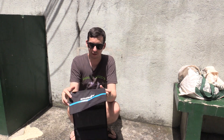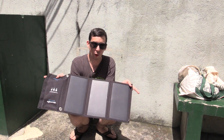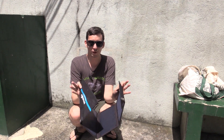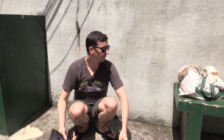Now the thing is, on the front of this it says 20 watts. In the instruction manual it says 15 watts. And in my testing, it's actually a maximum of 9 watts. So if you are planning to buy this, do your research, check pricing, because the maximum I've been able to pull out of this is 9 watts.